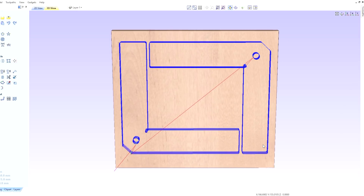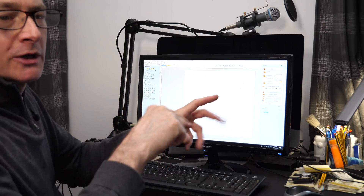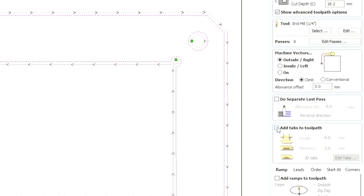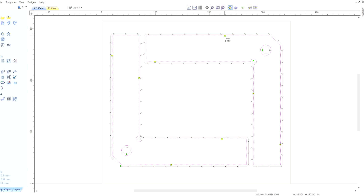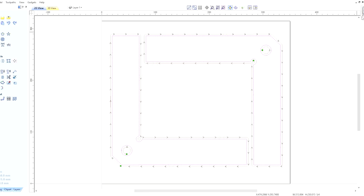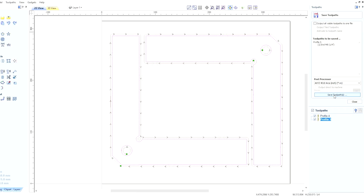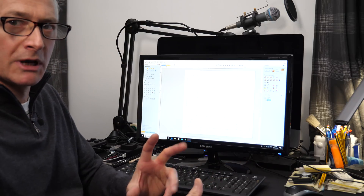Because we're cutting shapes out completely, I'm going to add tabs. Tabs are just little bits that are left behind which stop the middle bit from flopping around basically. So let's dive in and add tabs to the toolpath. These tabs are all editable — you can move them around as you choose and add more if you need. With those done you can then calculate, and save that out as a file. We'll call that 'clamp sq' and there we are, that's done.